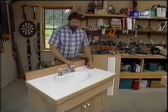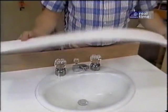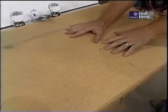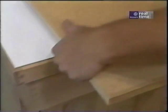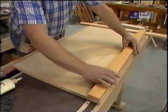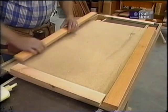The top for our dry sink cabinet is made from high-pressure laminate bonded to a piece of particle board — in fact this is high-density particle board, especially made for countertops. Because I don't want just three-quarters of an inch of thickness around the edge, I want this to be about an inch and a half. The first thing I'm going to have to do is build up the thickness of this particle board, and to do that I'm just going to use some one-by-two pine applied around the edges with some glue and screws.